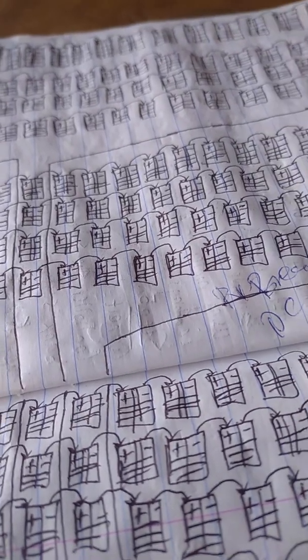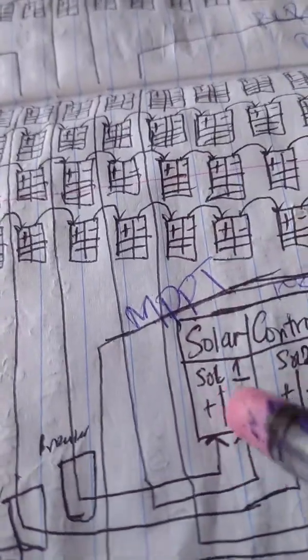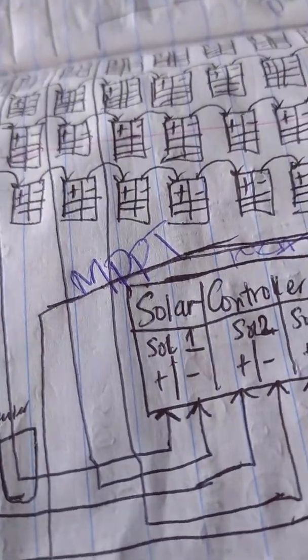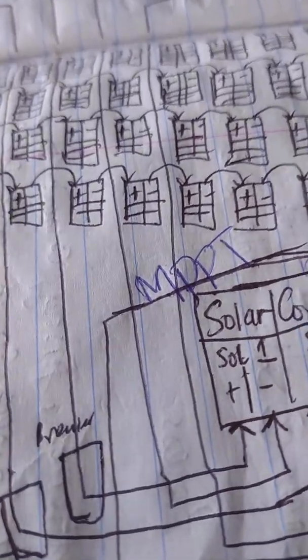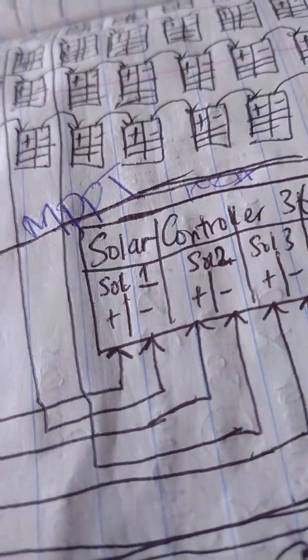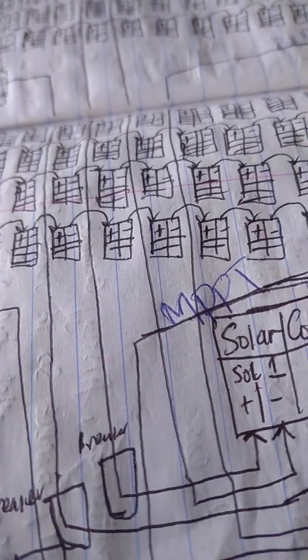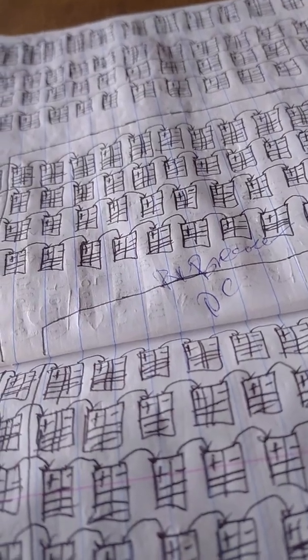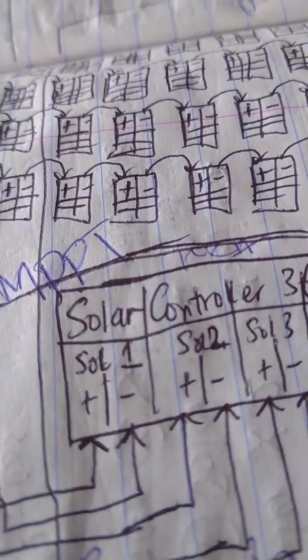Take your first set of panels to port one, set the ports accordingly. Connect your battery to your controller — the battery reading should already be around 360–390V before adding PV. After adding PV, all your breakers on — you might see the voltage rise above 360V to around 390, 400, or 420V. Don't panic — that is a normal reading showing that it's charging and the PV has enough current to charge the batteries.